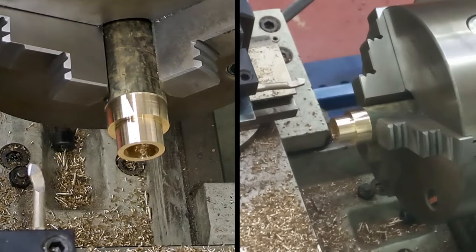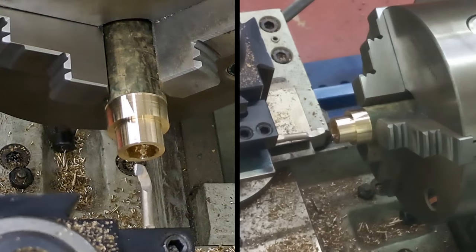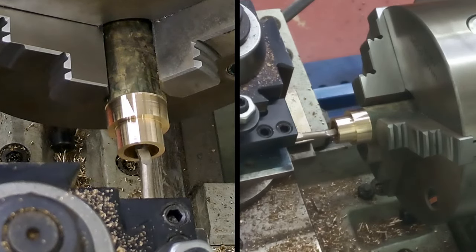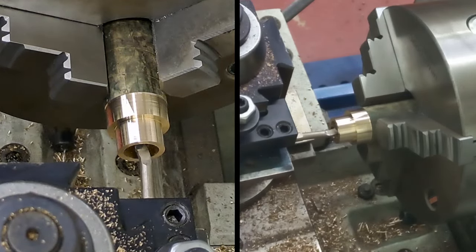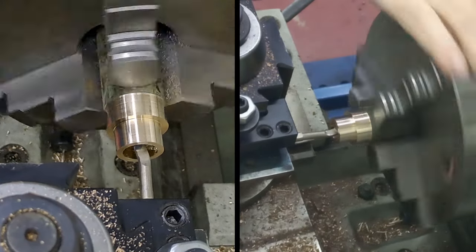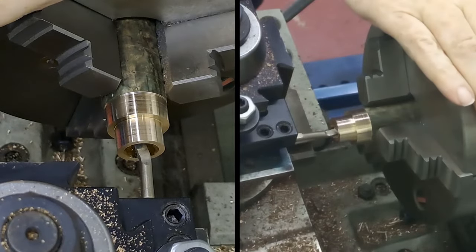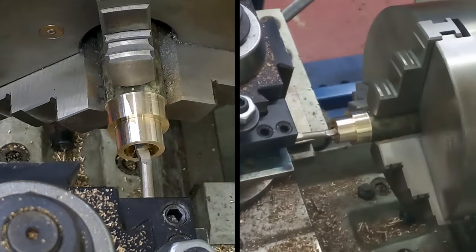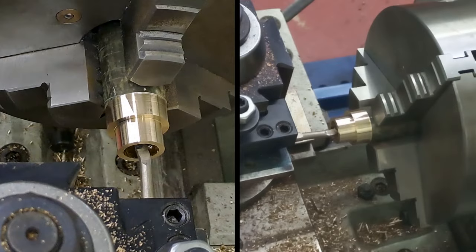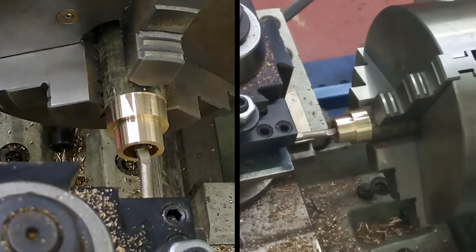Right, so wind in, put the tool into the hole, get the machine running. Yeah, take the speed back up a bit. Come on, into gear, thank you. Feels about right. And then bore it out slowly, slowly till we hit a size that will just fit that bar, the brake shaft.